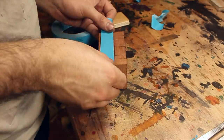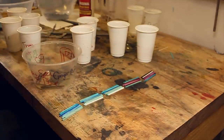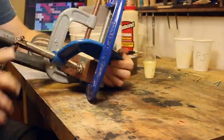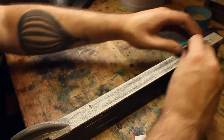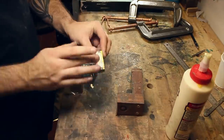I knew that gluing the 29,000 pixels in one go would be almost impossible without an error, so I decided to divide the guitar into a grid and glue 100 pixels at a time. Four little jigs were made to help speed things up. Referencing the drawing, coloured pixels were laid out on the bench and lifted 10 at a time into the jig with copious amounts of glue. They were then clamped and left for at least 20 minutes before the blocks were removed and the rough ends chopped. The blocks were then sanded on a levelling beam to ensure a good join with surrounding blocks. Once four blocks were complete, they could be glued together in a larger jig. With the immense clamping pressure required, three of my clamps didn't survive this step.